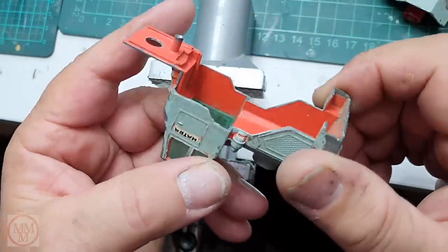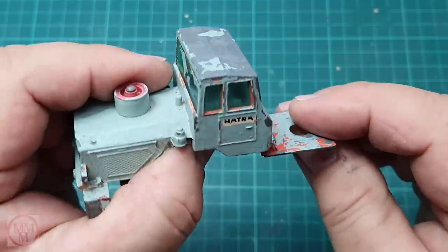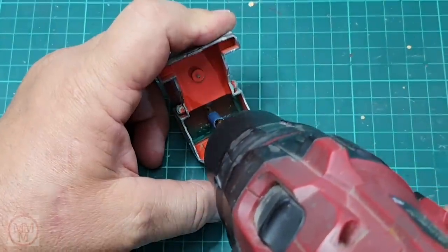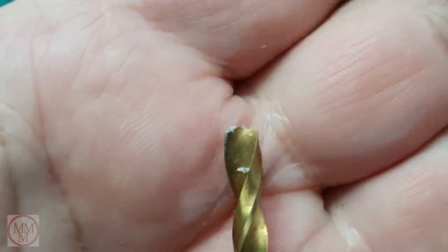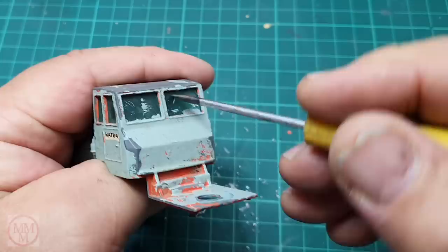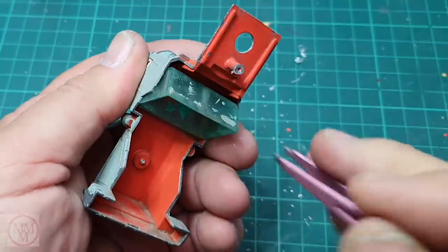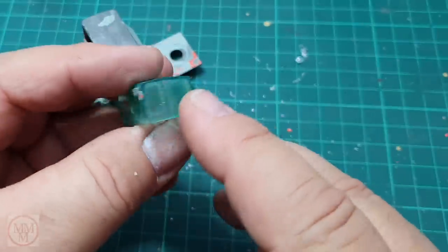And it means that we can make haste. As usual, I'm going to take that plastic out and try and clean the paint off and give it a bit of a polish. So I've got to drill that rivet out in the roof using this special drill that's got a shallow cut on it. The idea is I don't drill through the roof — it removes the material of the plastic first before the metal, so hopefully the plastic just drops out. You can see it's been modified, it's not as pointy as a normal drill. This is always fraught with danger — you sometimes have to lever these things out, especially when the model's been painted, because the paint can actually act as a glue. This one came out relatively easy by comparison.